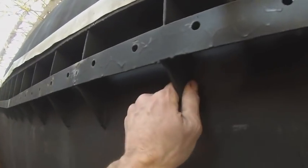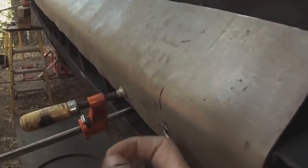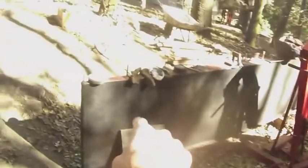I want to cover up all of these attachment points to make the water flow over the boat smoothly. I'm building it really close to the hull, which I don't actually want, because then if it vibrates it will scrape against the hull and cause a rust point. The reason I'm doing it that way is because when I actually put it on it will be further out, because it's going to rest on top of the nuts which hold the keel on.